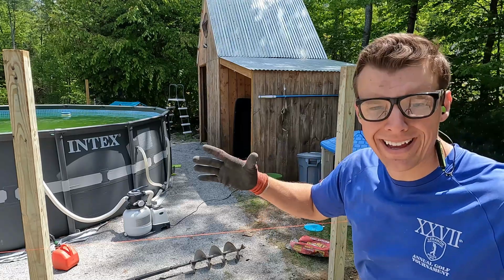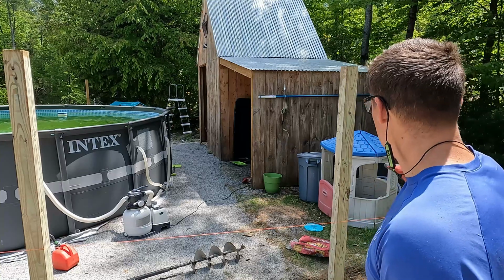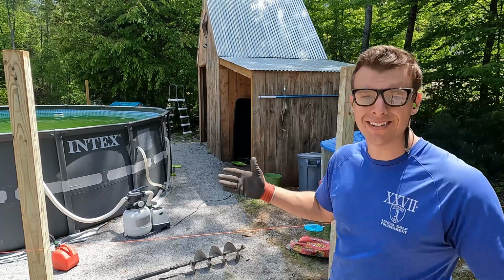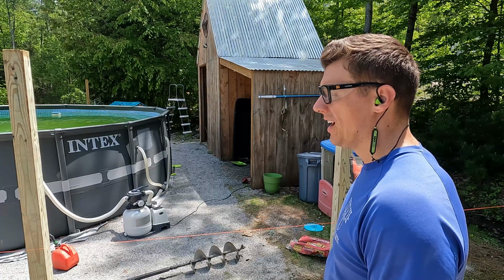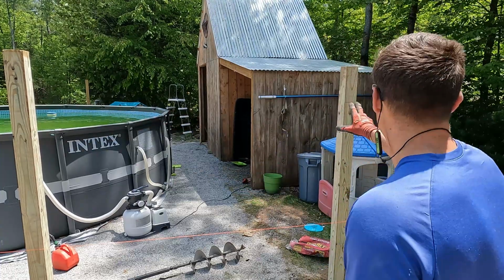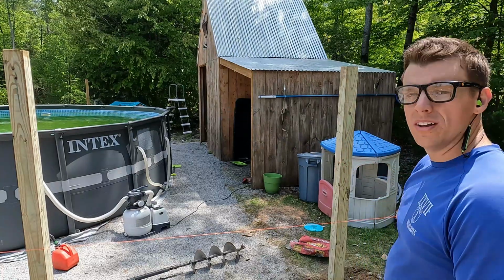I'm not a fence guy, okay? But we're getting this done at a good price, and that's the price it's going. So I might shim this piece. It's about 1 inch. It's embarrassing, okay? But it's gonna be fine when we do it. So I just snapped a chalk line from that side to that side at a pretty level. I marked level on these 2 posts, and then I ran the string line across, and it's pretty darn close. So that's what we're gonna go with.